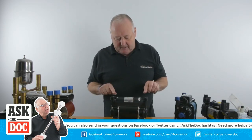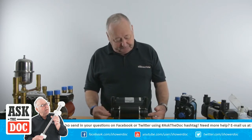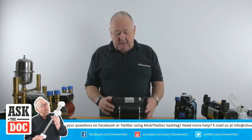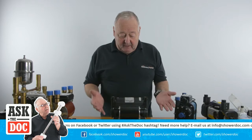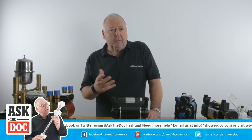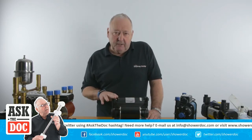This is a regenerative pump. The water comes in here, gets twirled around, and gets blasted out the other end. A fairly small pump and it really does the job. It would probably do a shower and maybe a bathroom, but you can't be pushing it for that. So this is a regen pump.